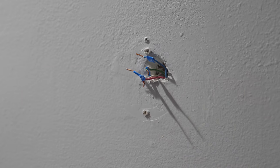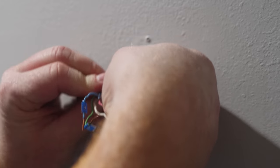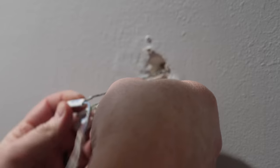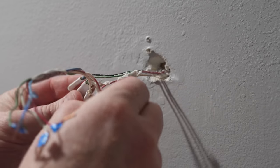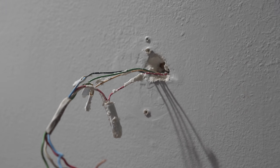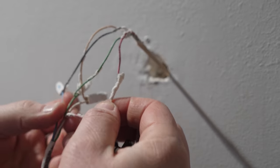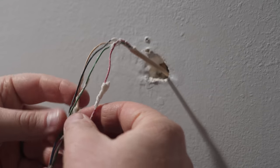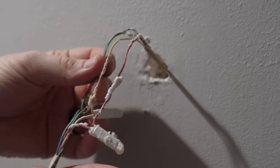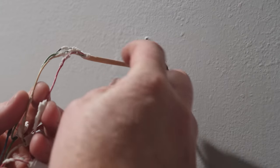Now that the base plate is removed we can see we have four wires, just as we knew before. But pulling this out, we discover there's more to the puzzle — we have a bunch of different wires spliced together and then the colors change. That's important info to know for later. Pull your wires out a bit to check, and make sure you don't drop the wire down through the hole or you'll have to fish it out.